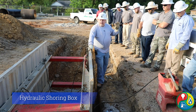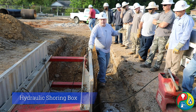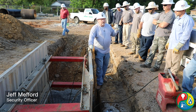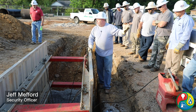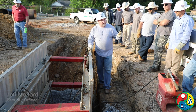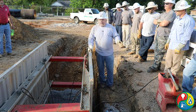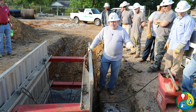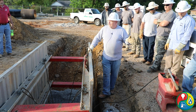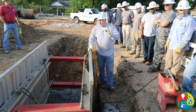First thing — whoever's coming to get the trailer, don't just back up to it, hook up and go. Don't assume that whoever parked it last did what they were supposed to do. Get off, look, check your tires, make sure the strap is still strapped down tight, and make sure there's oil either on the trailer or in the bucket in the pump. You look bad when you get out to the job site and it's like, 'I ain't got no oil.'